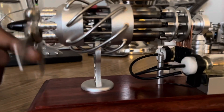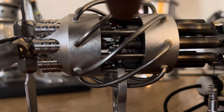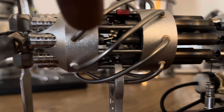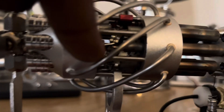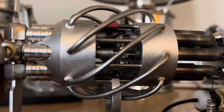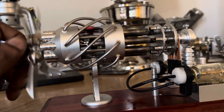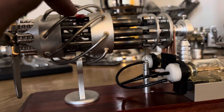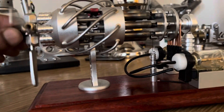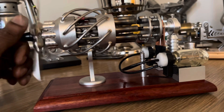I think a large part of that is due to the inherent weak point of this engine design, which I'm guessing is the linkages — the main swash plate and the main crank pins attached to it. With all these small miniature connecting rods, I could imagine over time as these engines run that puts a ton of stress on the connecting parts. In real applications, they need to be encased in oil — literally flooded with oil — hence why they've been enclosed in a barrel-like casing, to minimize the wear and tear that this particular design is subjected to.